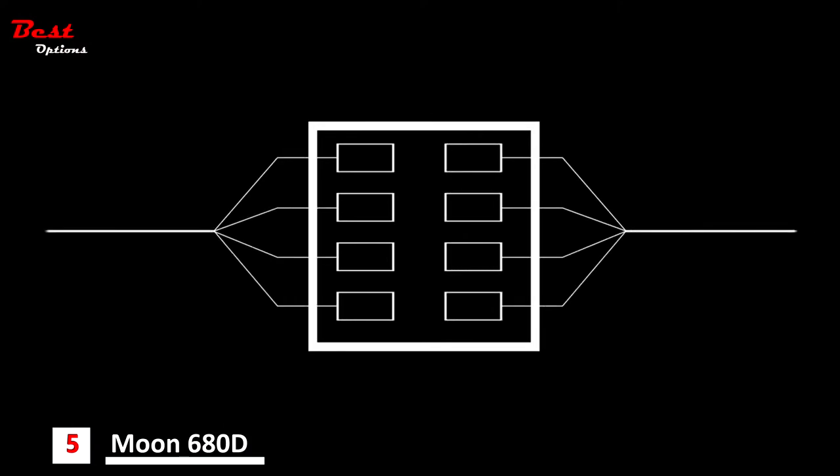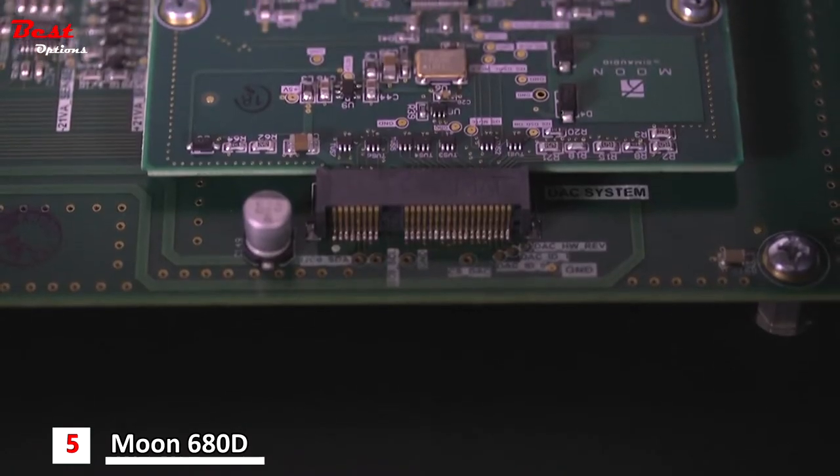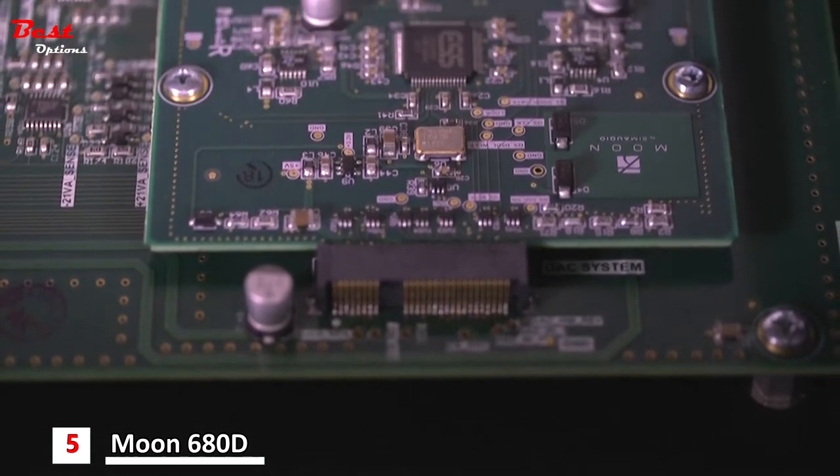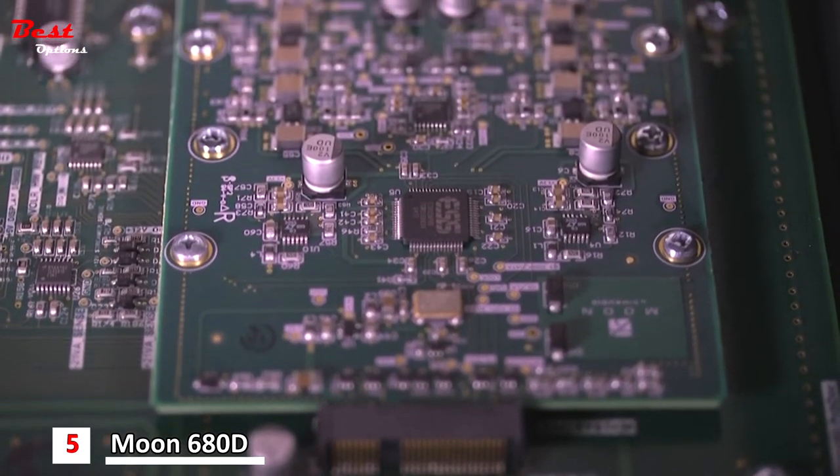Common distortion effect is reduced by calibrating each DAC so that none of them are working at the same level. The positioning of the clocking system and its dedicated precision voltage regulator is optimized to obtain the very best performance from the DAC.